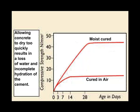This seems poorly understood, because many people in the industry think just the opposite — that it seems desirable to let the sun get at it and let it all dry out. That is the very opposite of what you're trying to achieve. Professionals must ensure that moist curing is always part of the process.